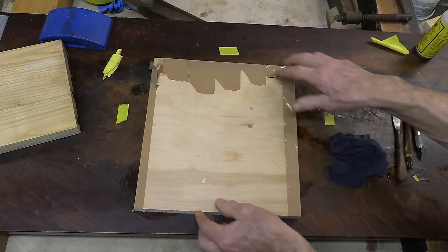It's a beautiful top. You can see that the finish is trying to fisheye. In other words, it's reacting in a seemingly weird way. So I just keep brushing it as it dries, keep brushing that orange peel out. My patch obviously needs color here, but I'm real happy with the grain pattern in this area. Wow, it really soaked in.